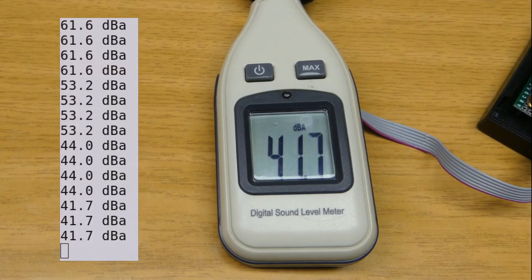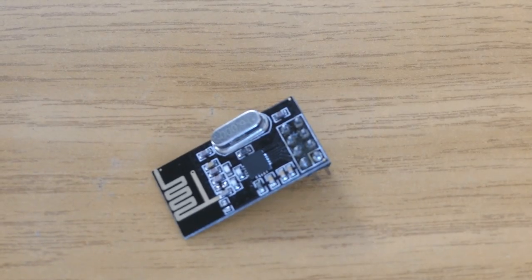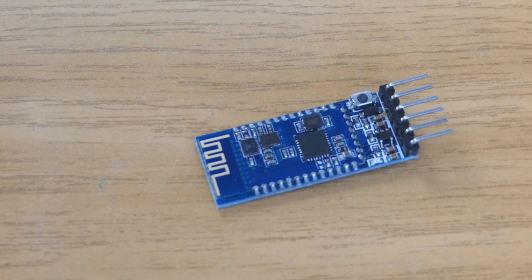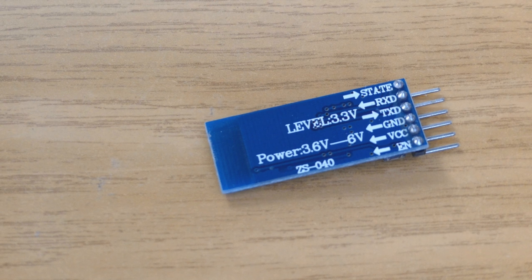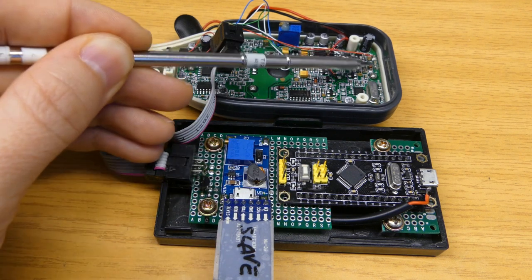Step 4: Transmitting the data. I want an easy way to get the value without connecting a computer via cable. The alternative is to transmit it over the air. We've seen the NRF24 — a simple and cheap device for wireless communication — but the receiver also needs such a module, which is not practical. We've also seen the ESP8266 which provides Wi-Fi, but it either requires an existing network or you connect directly and lose internet. Finally, we have Bluetooth, which fits perfectly: it is cheap, has enough bandwidth for simple measurements, and phones as well as computers can easily connect to it. We will use an HC-05 module — the microcontroller connects to it over serial, and the module advertises a serial port. We'll use Bluetooth Classic, which has a profile specified exactly for that; we don't need Bluetooth Low Energy since we will have a power supply. The device has a microcontroller to switch the meter on by simulating a button press and decode the measurements, Bluetooth to send them out, and a voltage booster to provide the 9 volts required by the meter.